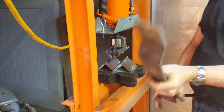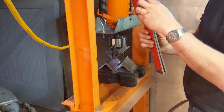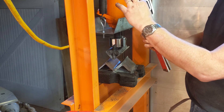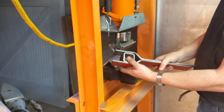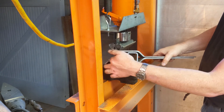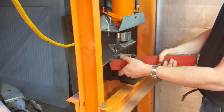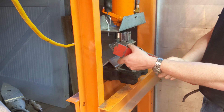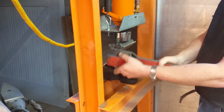What these should do is meet like so, where this two-inch square tube is going to be captured between them in a way that it can rotate. So this is what will function as a universal joint. This piece can rotate here, and there will be a steel barrel that can rotate inside there. When the hydraulic arm comes up and pulls the three-point lift arms up, this is the linkage to pull the lift arms up.